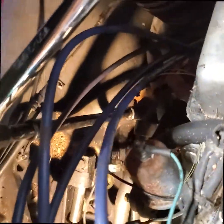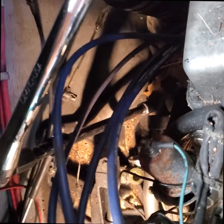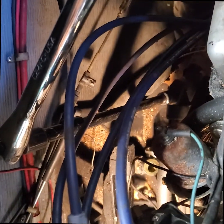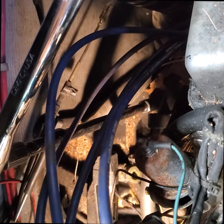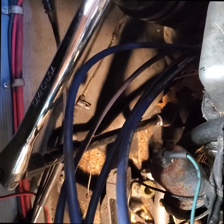Okay, I've got my 24-inch breaker bar here with about a foot of 1/2 inch extension and a 3/4 inch socket. And I've actually broken the last bolt loose, which is nice. So these are going to come out. But this is definitely what you want to try to do, is get a breaker bar on there and try to get them loose. If it doesn't come loose to the left, then try to tighten a little bit just to try to break the fastener loose, because you got a steel bolt going to an aluminum nut. It's a strange design that they came up with.